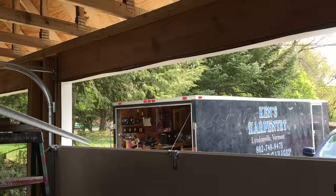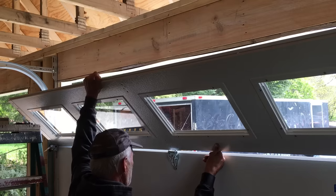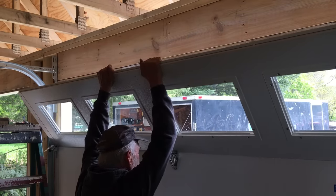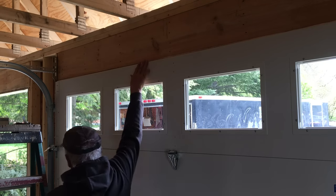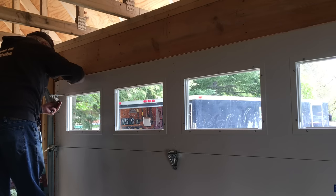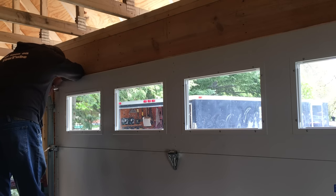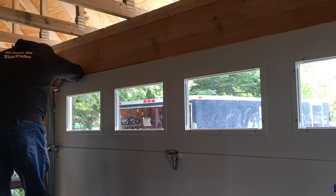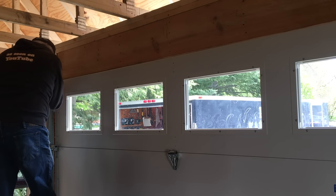And then the last panel — the glass panel. Generally you're okay to let it rest up there because it's hitting the sides and the top a little bit, but you should hang on. This bracket goes with the screws down, and there's a hole. The bottom one always lines up with something. They don't make all the holes the same for some reason, so they line up. I always go off of this one, going up as high as I can — it turns up above to clear because the ceiling height is eight foot one and a quarter, and the door height is exactly seven feet.